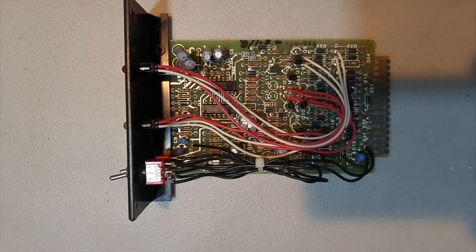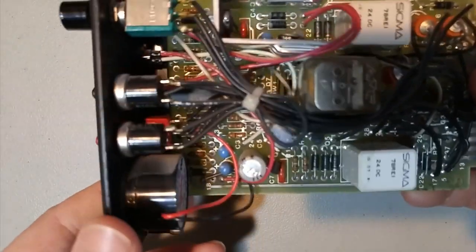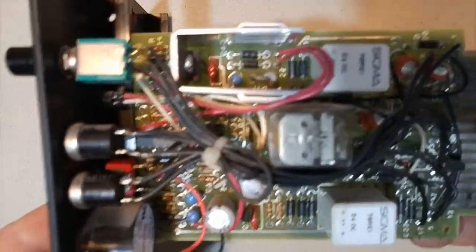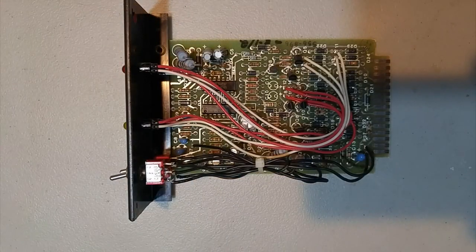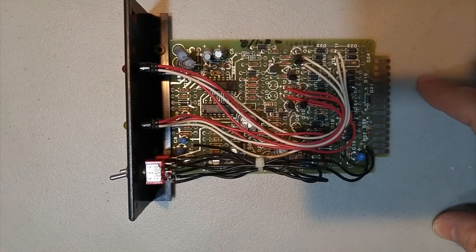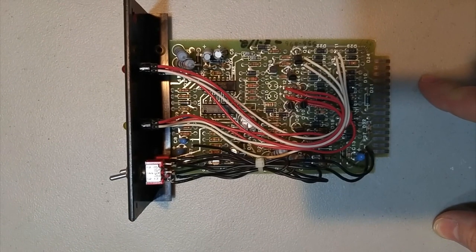It also turns on a small gate inside, which basically isolates the card from the blink circuit. Now, the main control card has a timer IC in it somewhere. I don't know where it is specifically, but there is a timer inside which sends out a constant blink, a constant pulsing pattern. That's what makes the LEDs in the panel blink. One of these pins is the blink input, and that's what makes the lights blink. That's why they all blink perfectly in sync.